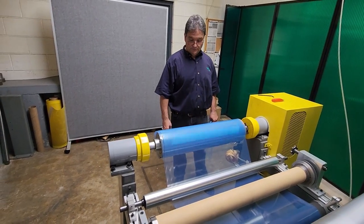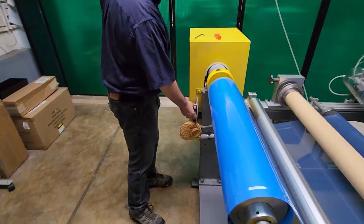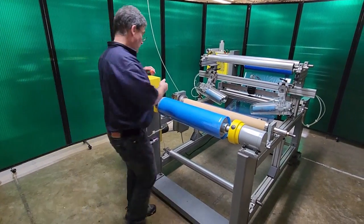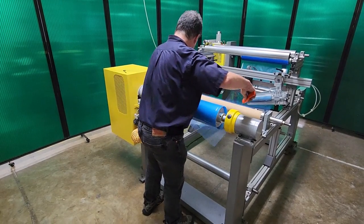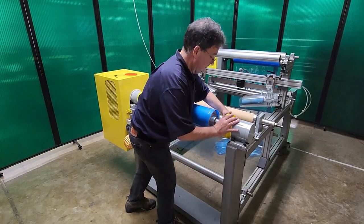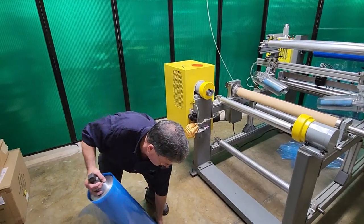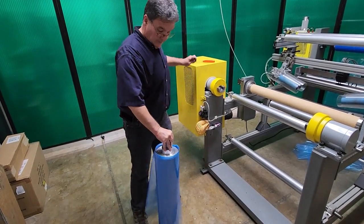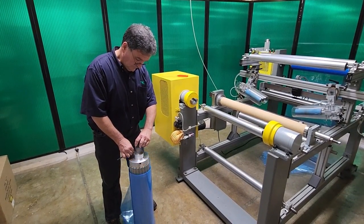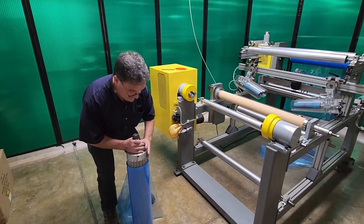You can see that's running. Let's say that's your full rewind roll — cut that off, cut the web. Open up the safety chuck, pull the air shaft out, deflate the air shaft, and then we can simply take the core adapter out.